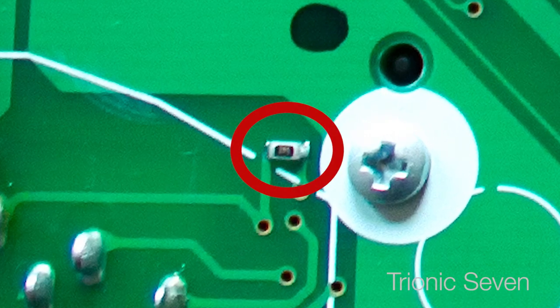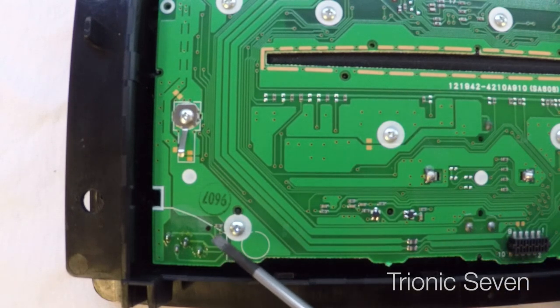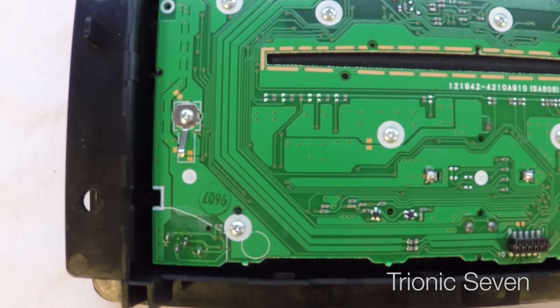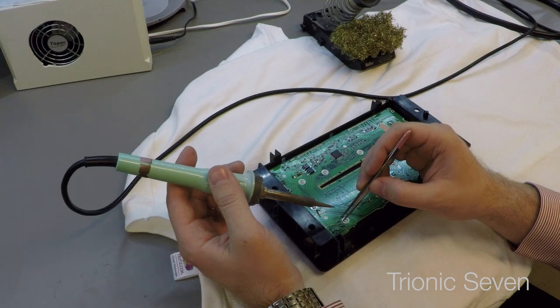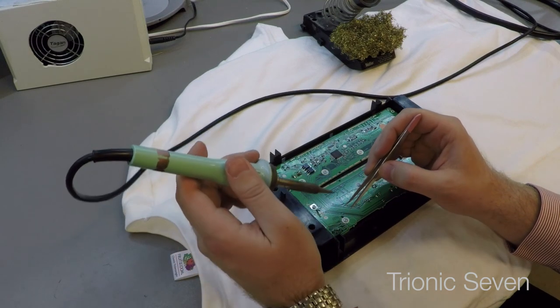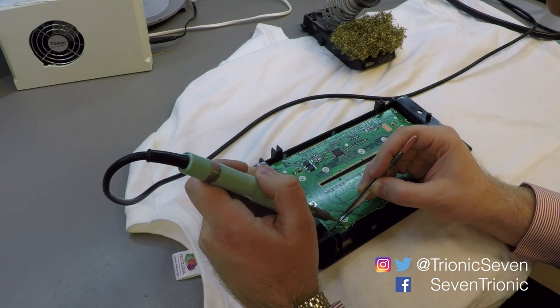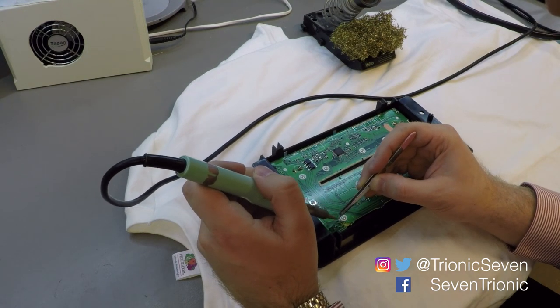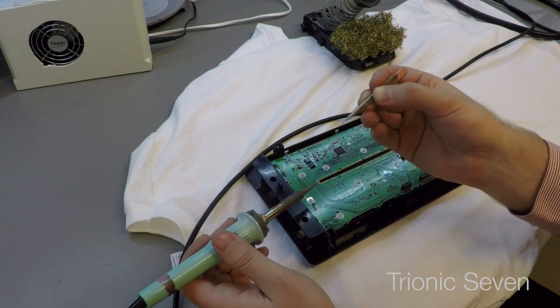Here in the bottom left corner there's a very small resistor that is surface-mounted to the PCB. For some strange reason the auxiliary port on this head unit sends voltage back to the phone or whatever is playing. These 3.3 volts confuse some phones, including my Samsung Galaxy S5. What I will do now is remove this resistor altogether, which removes the auto-sensing feature of the head unit. This is a very small component — if you're not familiar with surface-mount soldering, give this job to someone who can. I'm just an amateur solderer, but I'll remove it using fine tweezers and a soldering pen to heat up the solder pads. And there we go — I've now removed the resistor.